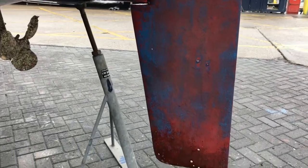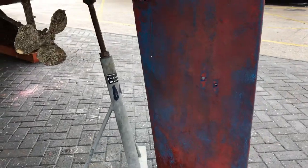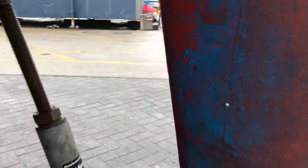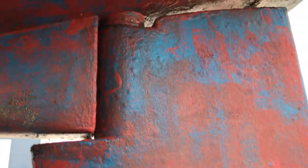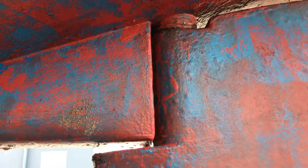Just coming aft, we've got the rudder, so we have a quick look over that to make sure there's no obvious damage, nothing against the leading edge, which is the part prone to catching anything if we hit something underwater. Make sure the bearing up there looks okay — and it does.